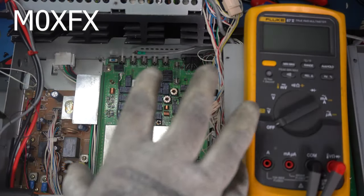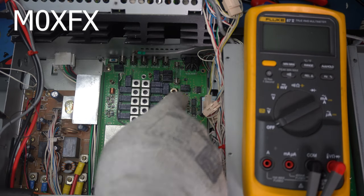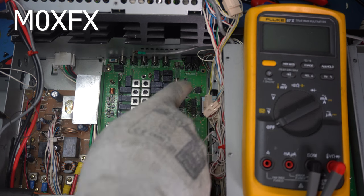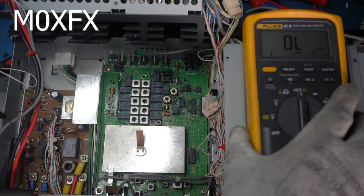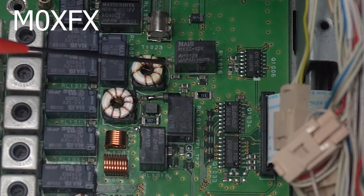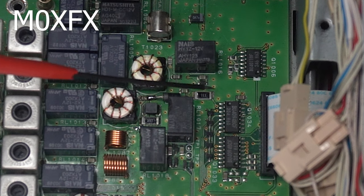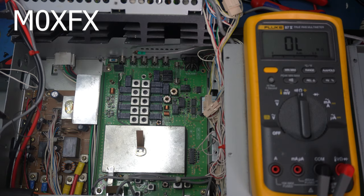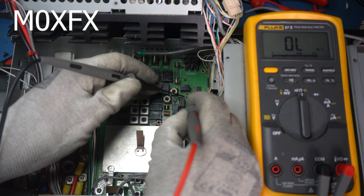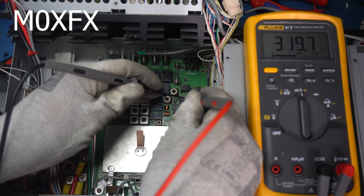As you can see we've got the board back in. I haven't put all the screws in yet but I've got it connected up — you need screws because the board needs to be screened and make contact, but I've just got the bare minimum in there literally just to test it. The first thing I want to do is check that switching diode D1055, which is being fed via resistor R159 — that's supposed to be a 330-ohm resistor. And yeah, that's on the money, that's pretty good.